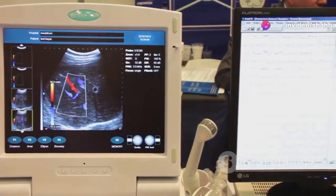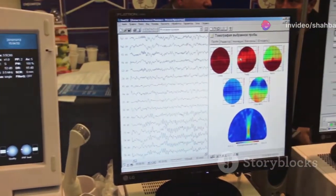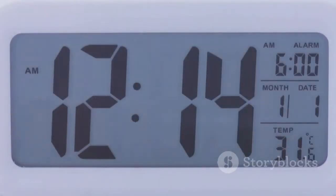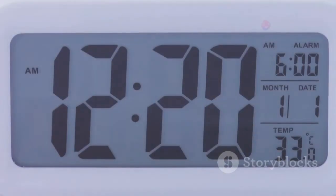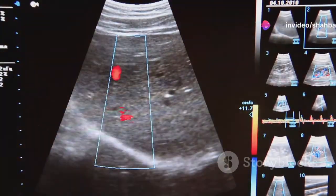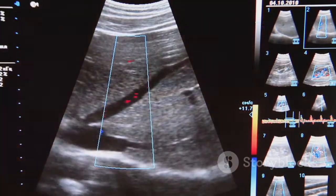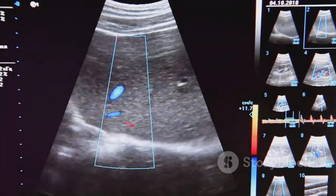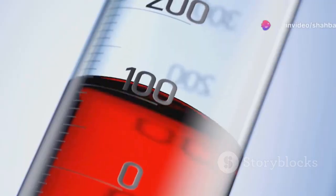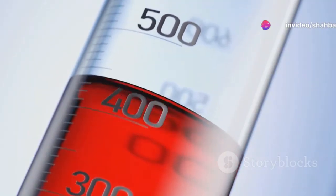Now let's talk about the importance of time-lapse between firing the sound burst and receiving the return echo. This time-lapse is directly proportional to the distance between the transducer and the material in the vessel. In simple terms, the longer it takes for the echo to return, the further the distance. This principle is the core of ultrasonic measurement technology, and it's encapsulated in the formula: distance equals velocity of sound times time divided by 2. These elements are crucial in understanding the functionality of ultrasonic level transmitters.